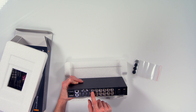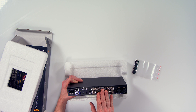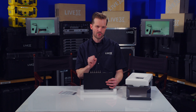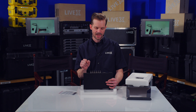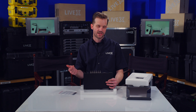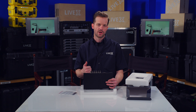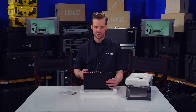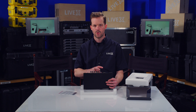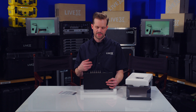The SDI inputs have outputs as well that aren't looped through — they are what Blackmagic calls 'talkback program SDI.' This allows you to use ATEM color control, camera control, as well as the talkback features and sending program back to your camera operators on the Ursa or the Studio cameras, anything that supports that. They've really tried to make this whole ecosystem of products for live production.